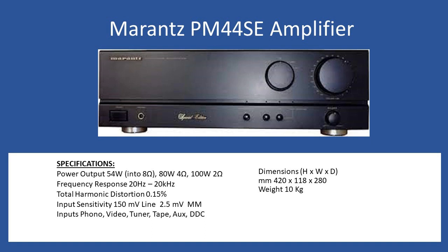The issue can also be attributed to the speaker output protection relays. These amplifiers have been in operation for decades, meaning a lot of switching of contacts and delivering current into speakers — the contacts become tarnished, corroded, and pitted over time, making them resistive. When you have an input selection switch that is heavily oxidized, a low-level signal coming through will still produce distortion even after slight amplification.